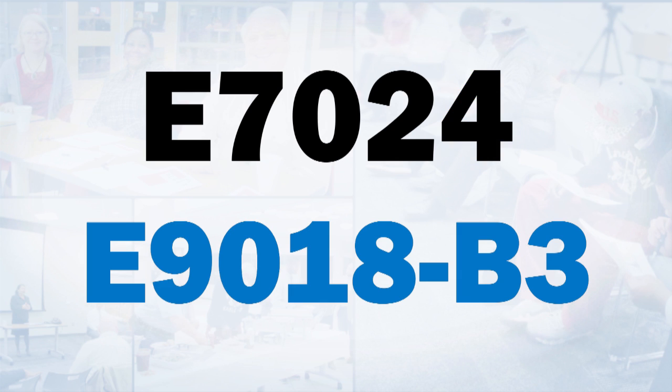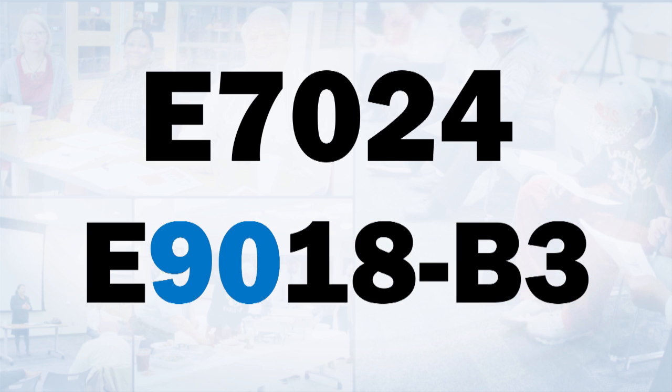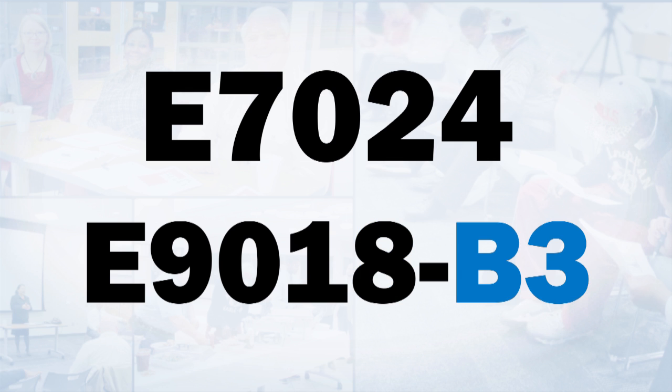On our next example, we have an E9018-B3 electrode, 90,000 pounds per square inch, all position. The 8 is one of 3 low hydrogens, so this rod has to be kept in an oven. And then our -B3 tells us the specifics of the alloy that that's designed to weld on.